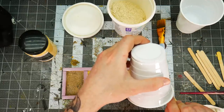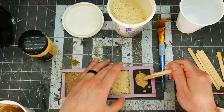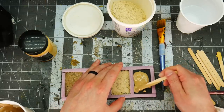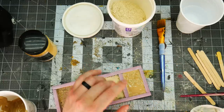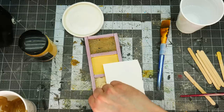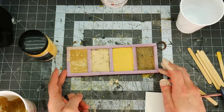I mixed up some grout with water to a fairly thin consistency, almost like pancake batter. I could then fill the recesses with this mixture so that it was flush with the beams — because it was runny it would mostly self-level. During the test I thought it was creating too smooth of a finish, so on half of the area I tried sprinkling on some of the dry powder to the surface to create more of a stucco look. I absolutely loved the results.